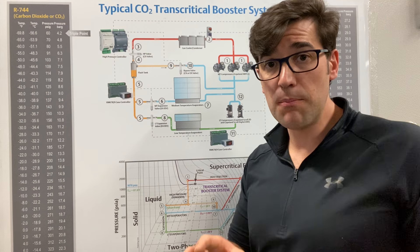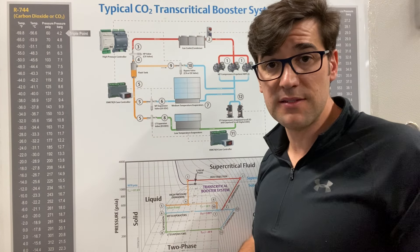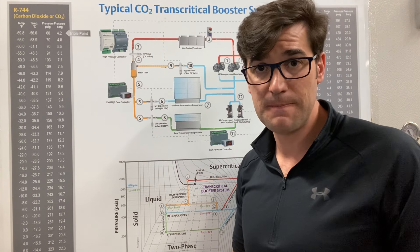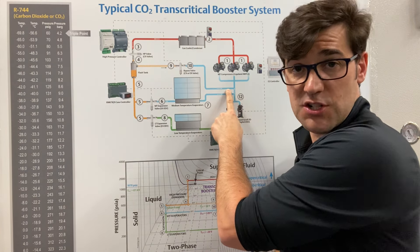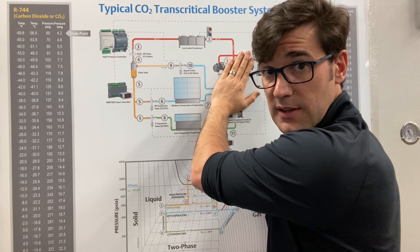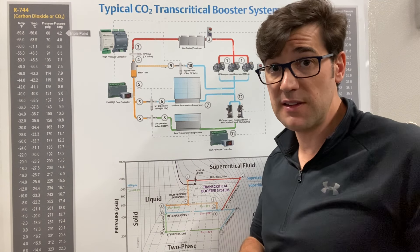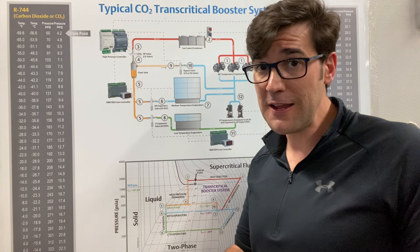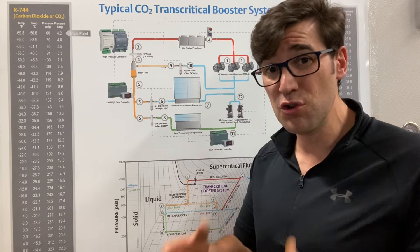With parallel compression, I'll give you a good example. Say you designed this basic booster system with three Copeland semi-hermetics — four MTLS, 15 horsepower — and you need three of them because of all that bypass gas. If you went with parallel compressors, instead of bypassing this gas back into the medium temp suction, you bypass this gas into a separate compressor, like an interstage compressor. Now instead of designing this rack with three 15-horsepower Copelands, you could potentially design it with one 5-horsepower and two 15-horsepower. Pretty cool — because now instead of wasting all that energy going back into the medium temp suction, it's useful work.